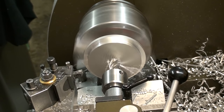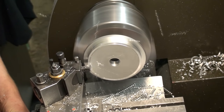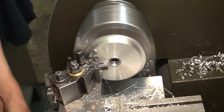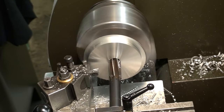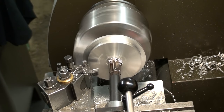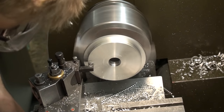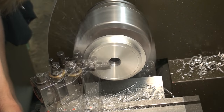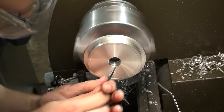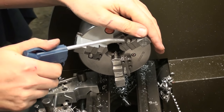I'm drilling out the center with a rotary broach, then taking a facing cut. I ream the central bore to 20 millimeters so it fits over the wheel hub — I was going a bit fast on the spindle speed there. Then I'm undercutting the face. This is the face where the cutoff disc will be clamped, and I want it to contact the grinding wheel only on the outer diameter, not on the whole surface — that's the reason for the undercut. Deburring the bore with the scraper, cleaning the chuck with some compressed air — be careful not to blow chips into the slideways.